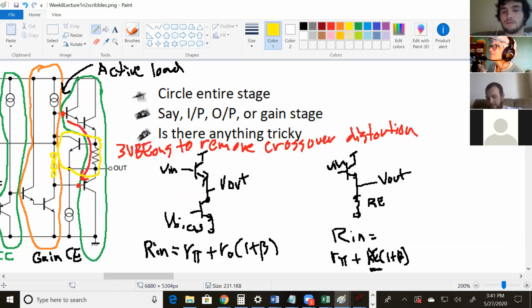So when you're changing the voltage at a node, you're charging or discharging a capacitance, and that current comes from someplace, and it's limited by a transistor or a resistor or something. So it looks like an R onto that C. If you're charging up a node, if you're making a voltage go up, you're charging that through a resistance. If the voltage on a node is going down, then it's discharging through a resistance. And either one of those looks like a low pass filter.